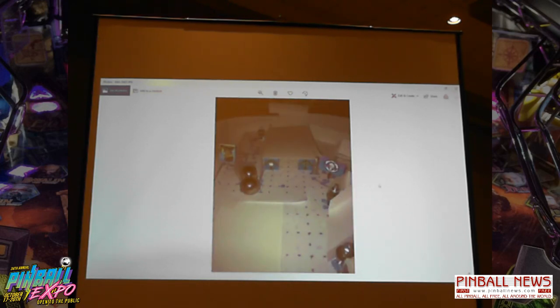And there's the foam cardboard mock-up of the drop target idea I had. So there'll be a hole in the middle. You can shoot the scoop in there, or you can knock down the one or three drop targets to lower the ramp. The problem was the ball just kept getting stuck. Even though it was routed out behind it, the ball just kept getting stuck. I was like, I can't do this.